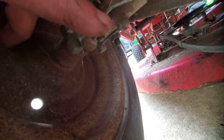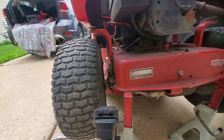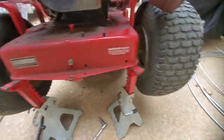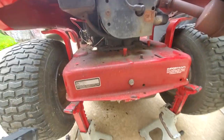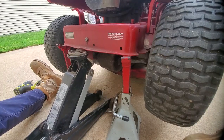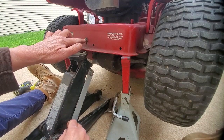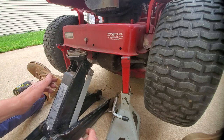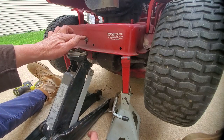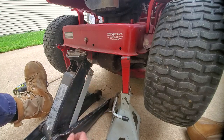It's just spinning the whole bolt now. Do that to both sides — bring it down about almost a half an inch — so that the transmission just comes down a little bit to make room for the belt we're going to put in there. The transmission's not dropping yet because we've got this one bolt basically holding it up.